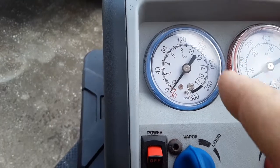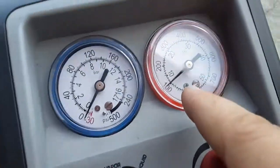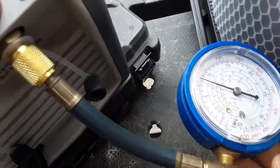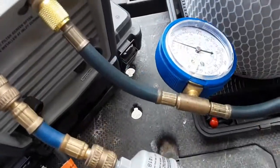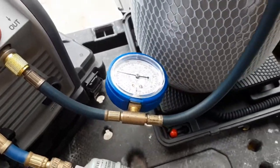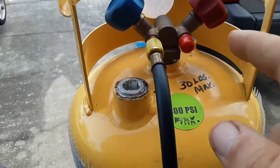Right now the compressor in here is pulling a low pressure on this side, which helps to draw the refrigerant from the can. And then it comes out on this side here — it says 'out'. It's pumping it at 100 PSI out the discharge or output line. This line here just so happens to have a gauge in between. You can see: blue is low or vapor side, red is liquid or high side in air conditioning systems.